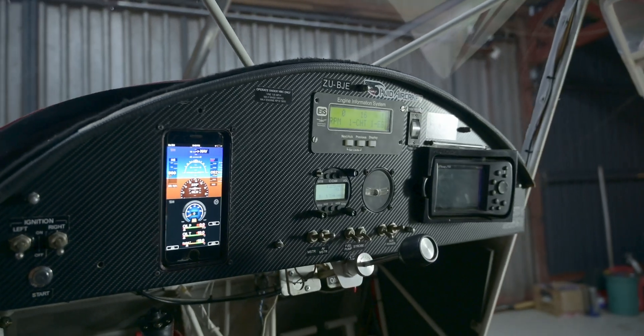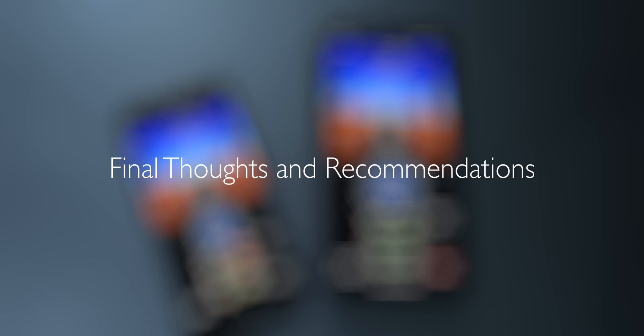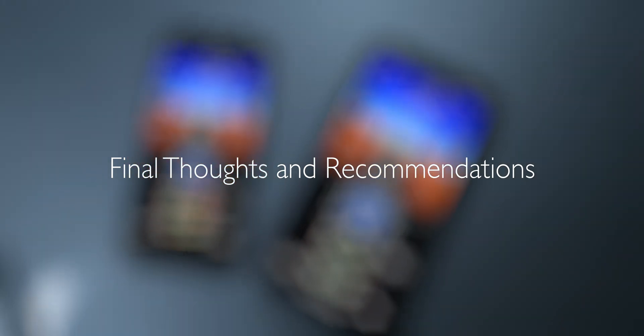I really like the i-Level 3 AW. I think it perfectly fits our goal for the project and it's definitely a conversation starter with anyone who peeps into the cockpit — they call it the Level Effect. It's a unique solution to the avionics question from a very friendly family-run company, making the glass cockpit available to more people at an affordable price. There are a few things I'd like to see added: true airspeed and density altitude readouts would be a fairly easy software update if you have an outside air temperature probe installed. Audio alerts for high temperatures, low fuel, or low airspeed would also be a great addition.